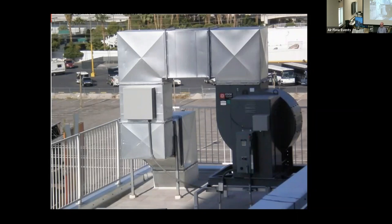So rotation and discharge, if you go back to the engineering cookbook, all of the AMCA rotation and discharge is available. Now, what am I talking about, rotation and discharge? That's why I'm using this example. Okay, this fan, all rotations are referred to from the drive side of the fan. So notice which direction my cursor is going. The drive side, meaning the side where the motor is located. Yes, correct. So this is a clockwise rotation. Notice my circular motion is clockwise.